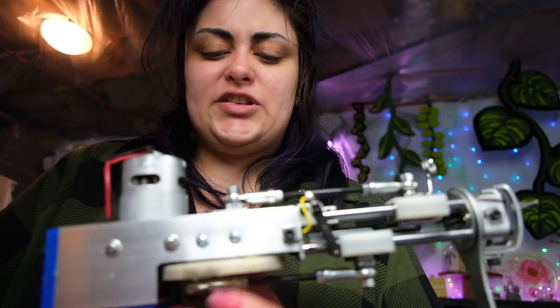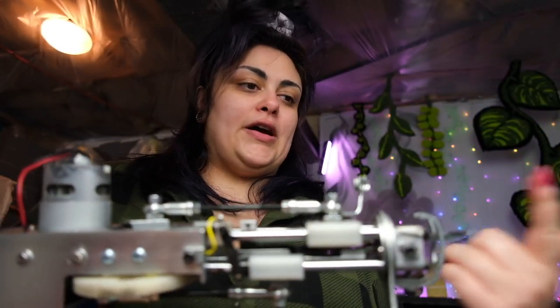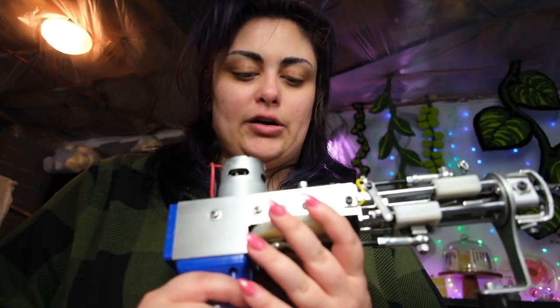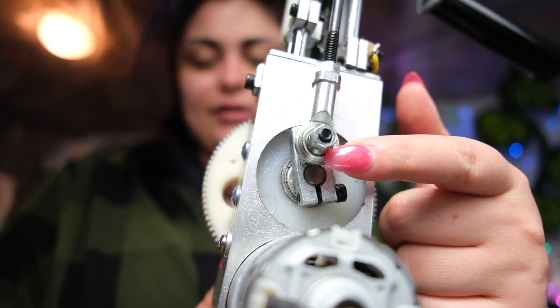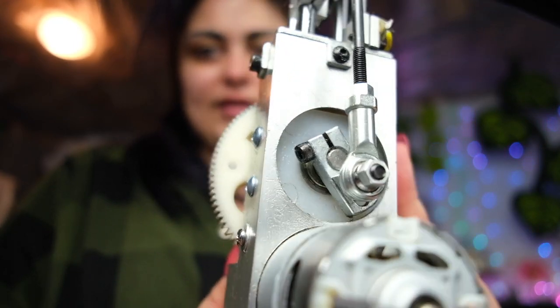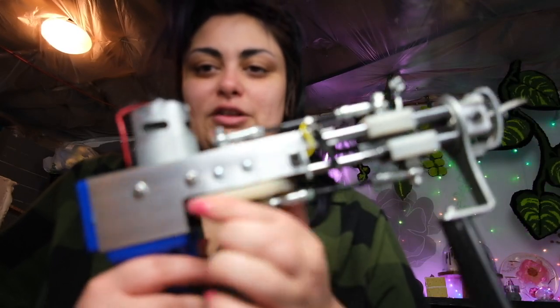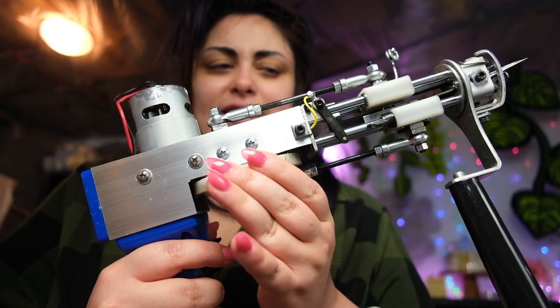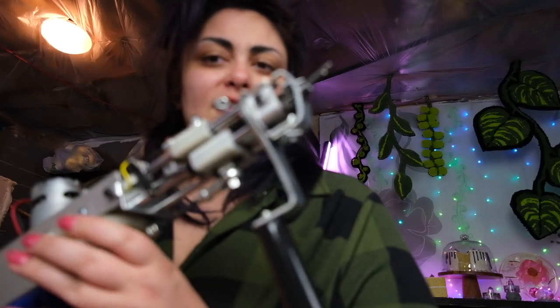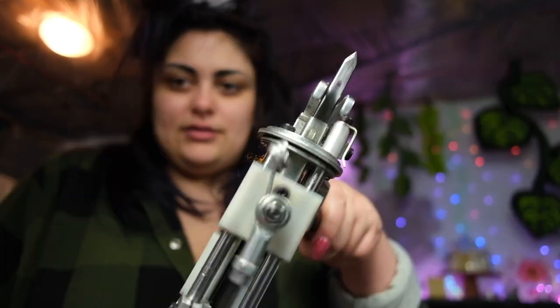Another thing, when I was spinning this gear, there was a point where it felt gritty. It would go around nicely, and then it would get to a point where it felt a little hard. Obviously I usually put oil in here, but then I saw this in there, which is also going around when you're spinning the gear. So I put a little bit of oil in there. I don't know if that's recommended. That's not something I've seen anybody do. But since I did that, it's much more smooth. There's still an area where, right when the scissors are all the way extended, it stops. It'll keep going, but for the most part, it feels okay.